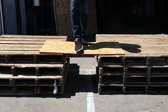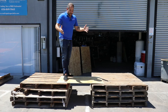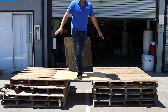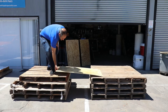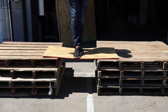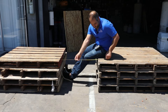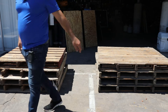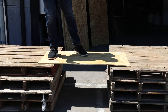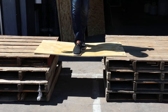Moving up to 24 inches — this is the widest standard roof rafter span. Testing plywood at 24 inches: I'm safe, just hearing light cracking on the CDX. Now the OSB at 24 inches: seems good. Moving up to 28 inches — this is wider than any standard roof. I'm a little nervous, but testing the plywood at 28 inches and it seems I'm safe for now.